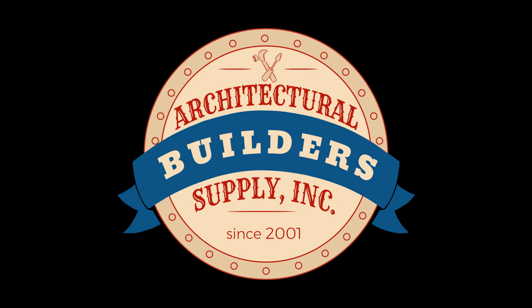Awesome. So the bottom line is I've spent years looking at this stuff, as it sounds like you have, and I just needed to have like minds agree that would be the approach. I need to actually print this because that's not right, and I need to give this to my design engineer. They've got it at that dotted line, and from that dotted line to there is not an inch. It's from the plate to the bottom of the arm that's the inch. Because if you maintain that, then your arm will not be sitting on the thrust bearing.